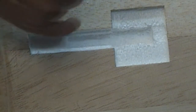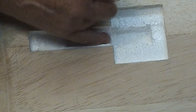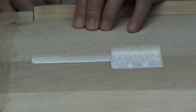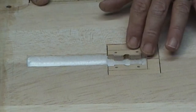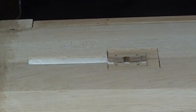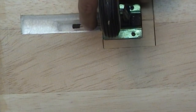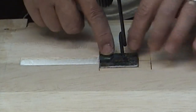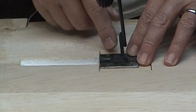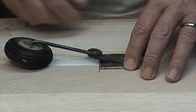There you have it. You can see the groove that your clevis is going to ride in, connecting to the retract. The retract hole itself. The cutout for the platform. Let me show you how all that's going to fit. The plate sits just underneath the balsa - about a sixteenth inch, just flush with the underside of the balsa. The retract sits down in there. The depth of this channel is the same depth as the retract. So what I need to do now is drill these four holes on the drill press, mark them with a pencil, put some blind nuts on the back side, and screw it down.